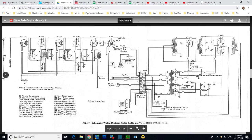So over here are the parts list, quite handy. C9 2.5, C10 3. Now I can easily do these with electrolytic capacitors. It is a power supply. Well, there's another one, C5. I missed that one. So 9 and 10, I can only do them by electrolytic.